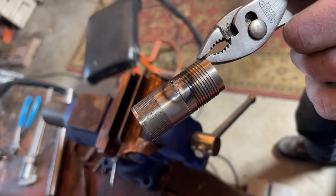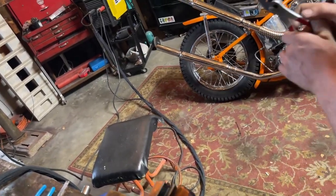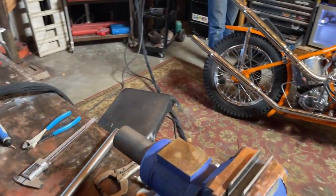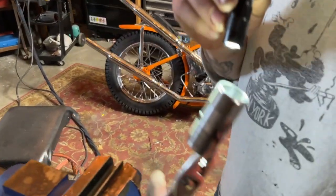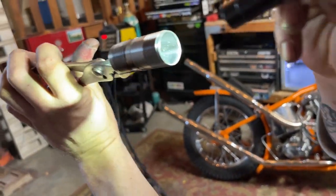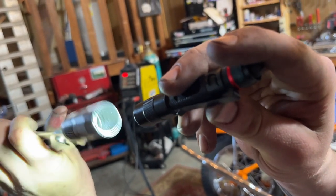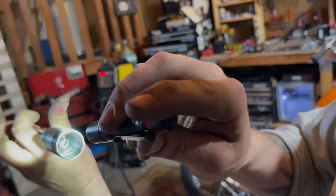Really the joint quality at all, because we're just trying to see what's going on with it. But the big thing is, let me get my phone. It's stuff on the inside, right? You gotta make sure that there's limited penetration. So you can see on that first one we blew through and material sank through. And that's also kind of what happened when we got this going, because we were heating it. So anyway, we're gonna wanna focus on that. We'll kind of pull it in.